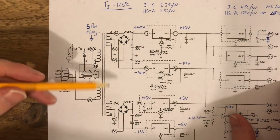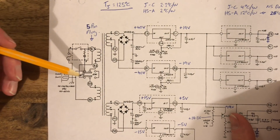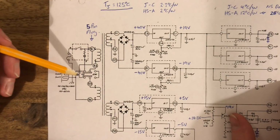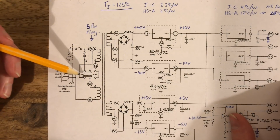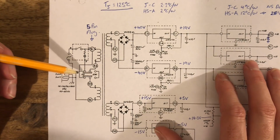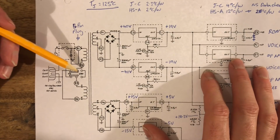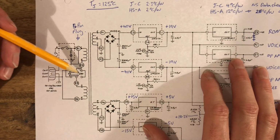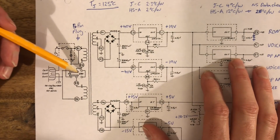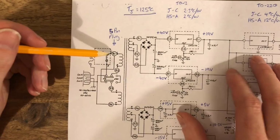We start off with our transformer, which is a big one. Thankfully, it is configurable for different mains voltages, just the two average high and low voltage ranges. So the 230 covers the 220 and 240, and the 115 covers the 100 to 120. Incidentally, 230 volts is the official Australian standard voltage, although the whole country runs on 240. It's the same in Europe, where the standard is also 230, except that everyone runs on 220. So basically, everyone's lying.